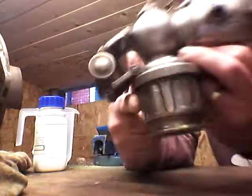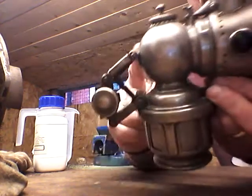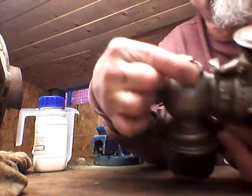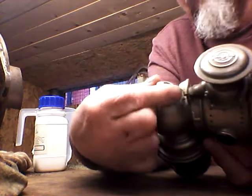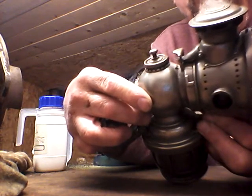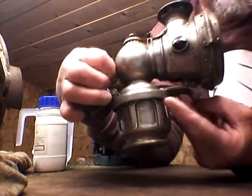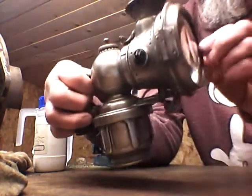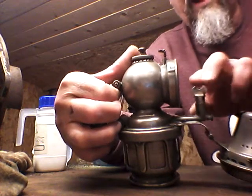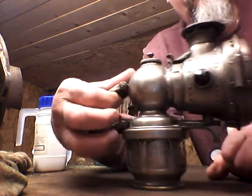Let's look at the various parts. At the bottom we've got a chamber which is going to hold the calcium carbide, and the top half has a chamber holding water. On top of that is a control valve which controls the amount of water dropping onto the calcium carbide. Dropping water onto calcium carbide produces acetylene gas, which runs along this tube up into the burner. There's a little ceramic burner that produces two flames, which then produces a brilliant white light.